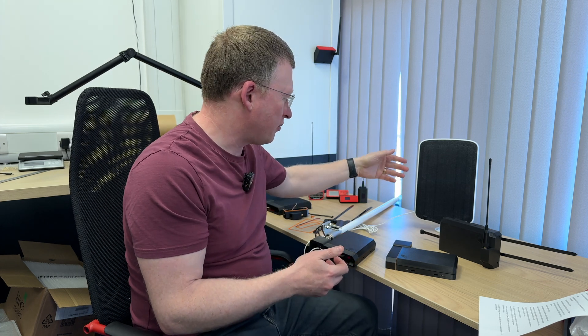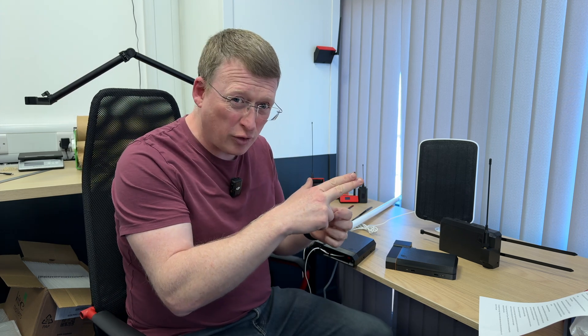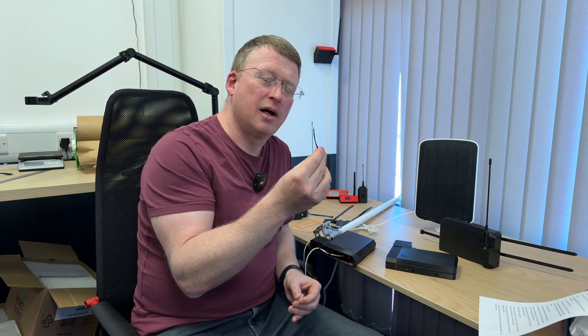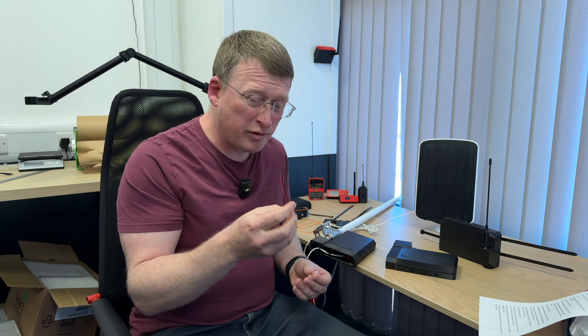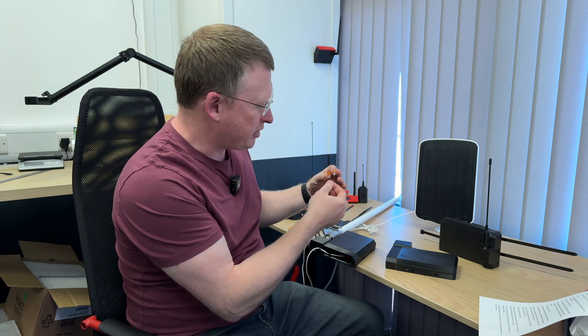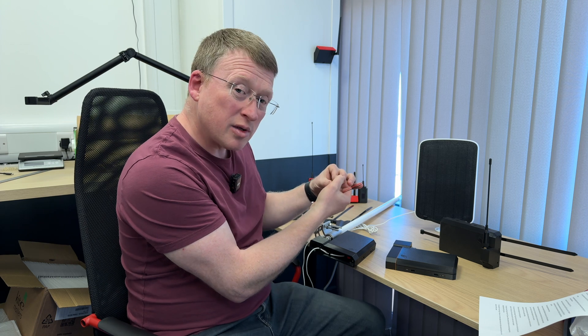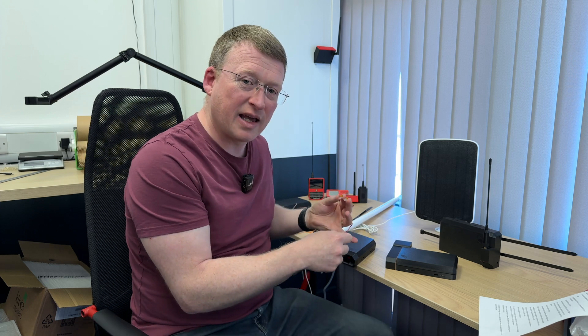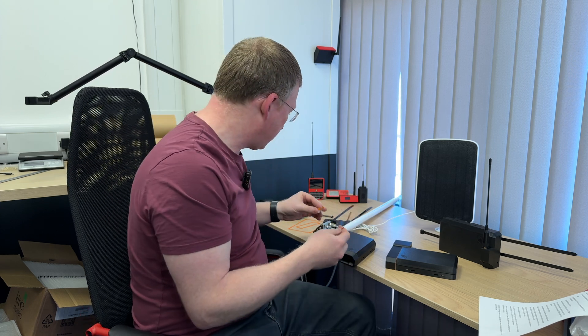For the solar panel, there are loads of panels available designed for security cameras or doorbells. The cable they terminate to is generally a USB cable. You simply cut that connector off, and I include the solar cable that attaches to the Rack board. You don't need to solder — I include little crimp connectors. It's literally just a case of inserting your red wire and squeezing with a pair of pliers to crimp the cables together. There are cable tie points within the case to secure the cable and ensure there's no cable strain.